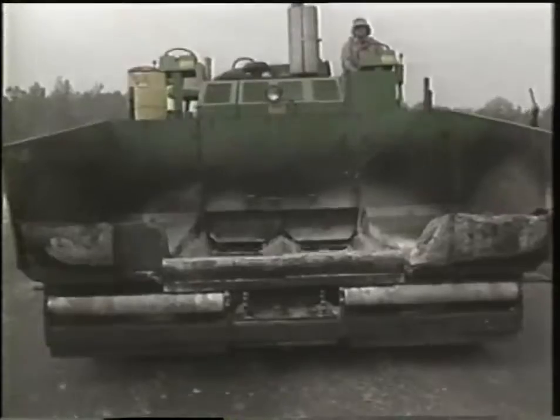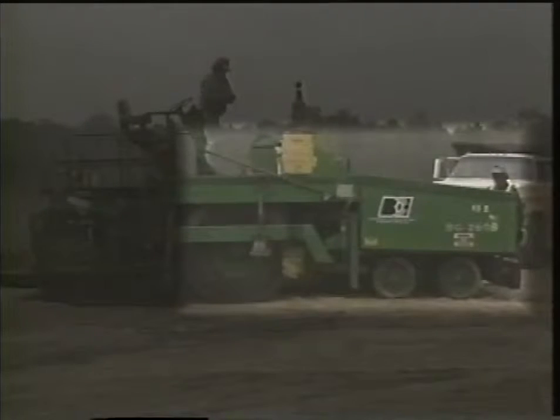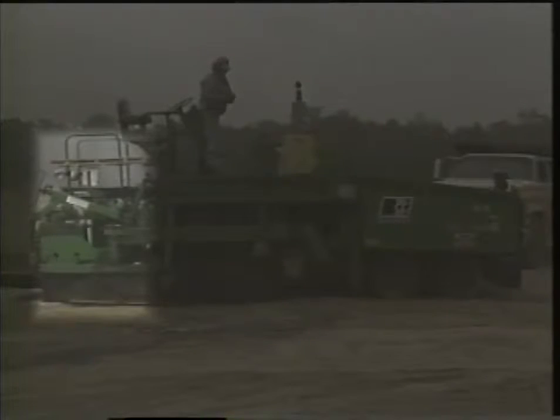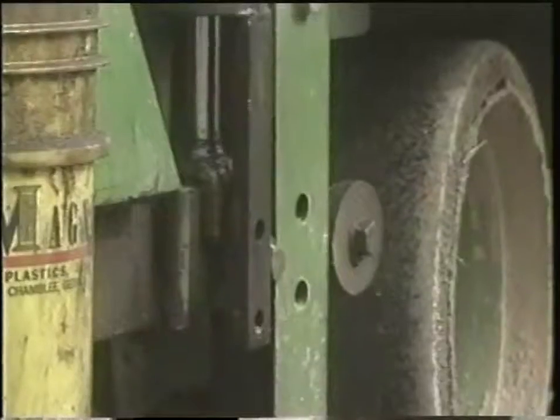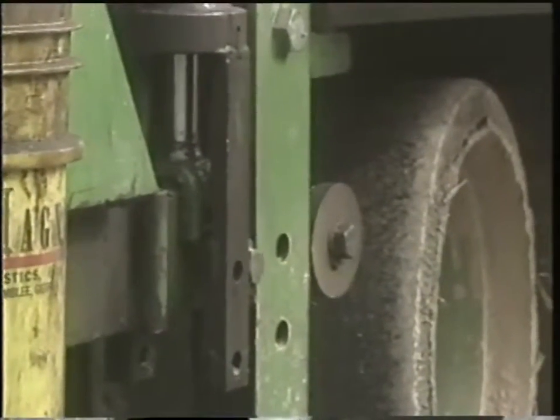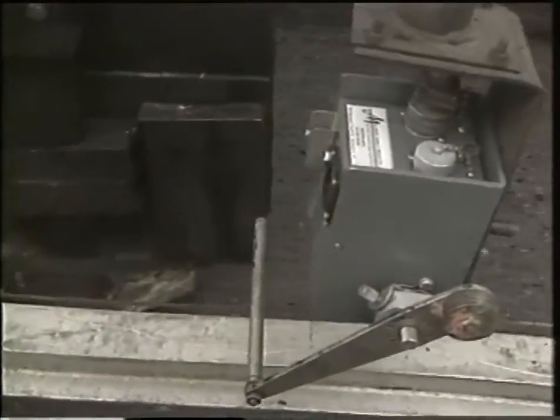The hot mix is loaded into a paving machine. The machine has two parts: a tractor unit that mixes and lays out the hot mix, and a screed that levels the surface. The two parts are hooked together by big lever arms on either side that allow the screed to float on top of the mat. The thickness and slope of the mat can be controlled by hand or by automatic leveling devices. The paver operator makes tight joints between adjacent strips of overlay and at the end of each strip.